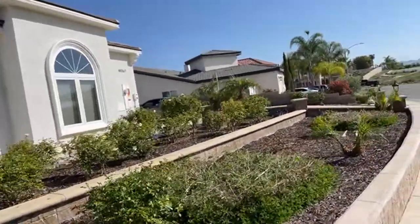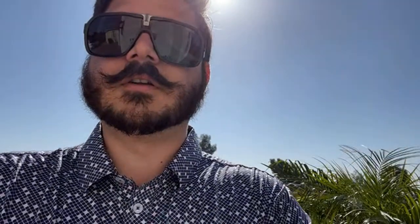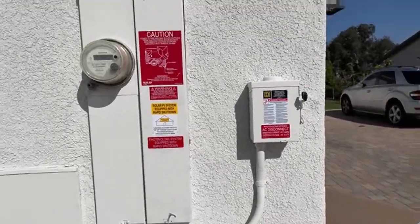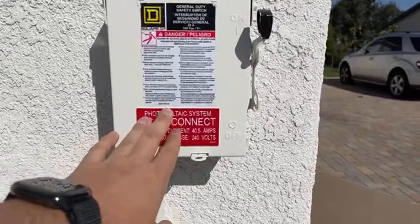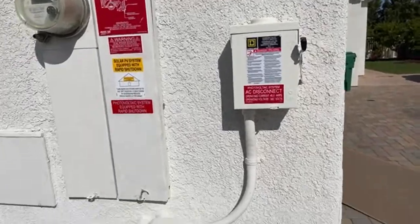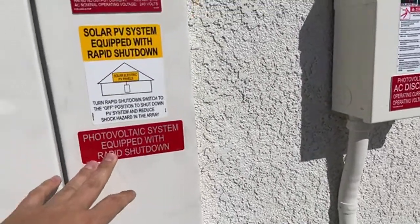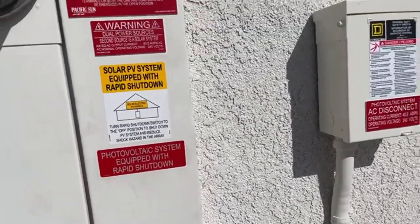When it comes to solar, a lot of the code requires that you install these stickers — I know they're for safety, but customers always ask about them. In the United States people think solar is extremely dangerous. For Enphase, it's all AC, so it's no different than all the electrical in your house. You have the AC disconnect for first responders — they can shut that off and there's no AC voltage up on the roof or in any of that conduit. This is rapid shutdown, and I think almost half the states in the U.S. have adopted that.